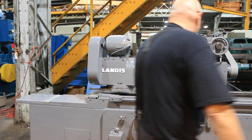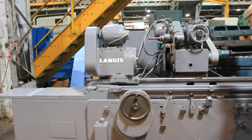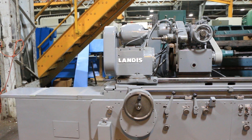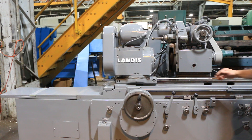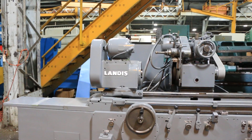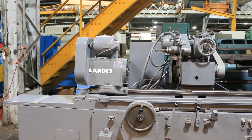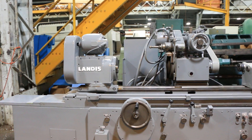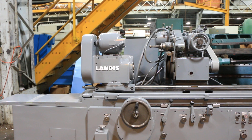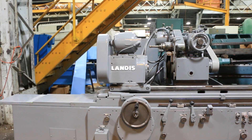This is your table speed control. These two are for dwell. The tailstock is over here. The headstock is alive and dead, meaning it can spin and turn the whole spindle, or you can lock the spindle and just turn the outside portion to have a dead center — rotating on the dead center for center-type grinding.